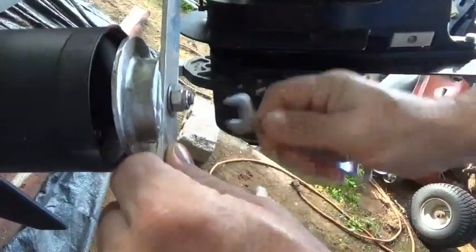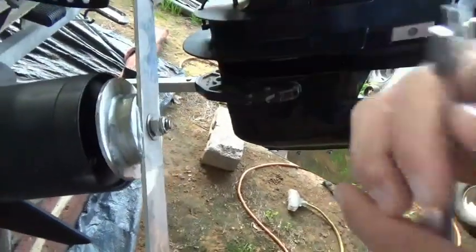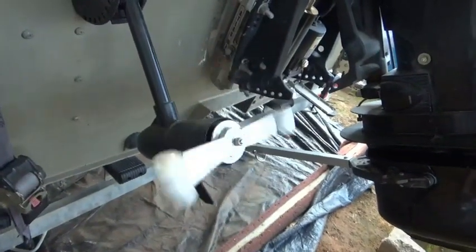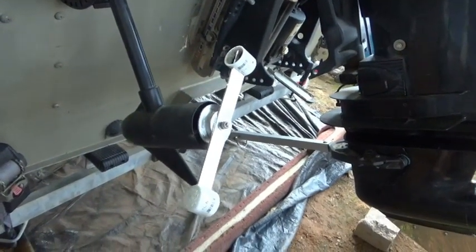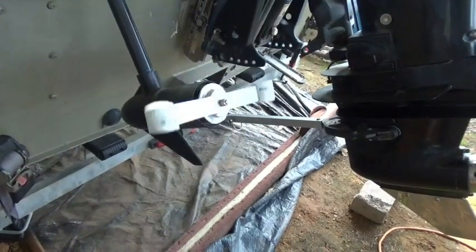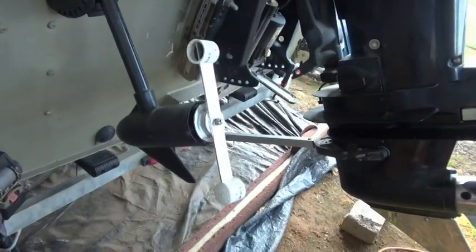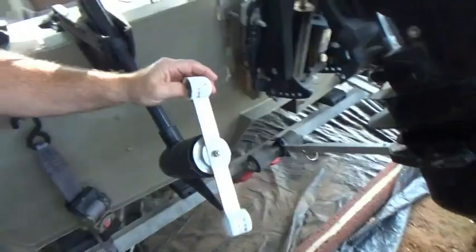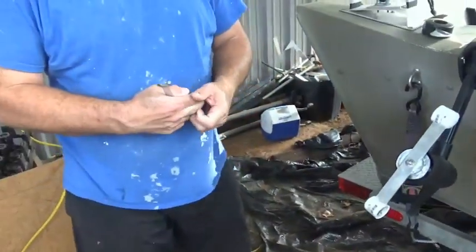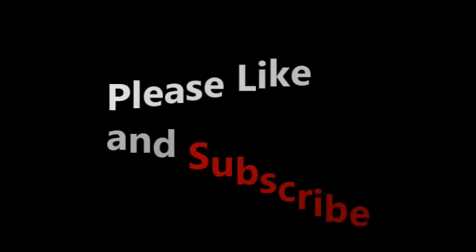I'll show you how this thing works. I'll tighten it down to where there's no wiggle in it — that'll hold it on. Now I'll put the trolling motor on. That's called a splasher prop and it'll help you keep the stripers underneath your boat. There's my splasher prop — I can go forward or backwards with it. Just run it as slow as you can and we're ready to go striper fishing! That thing right there will throw some water on you. Watch my video on how this thing performs on my short video for splasher props — it'll amaze you how well it works. Please like and subscribe.